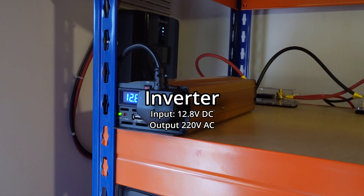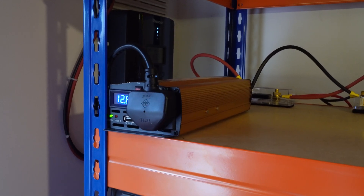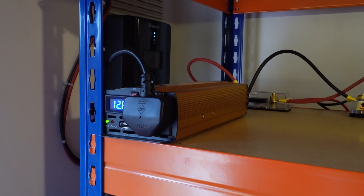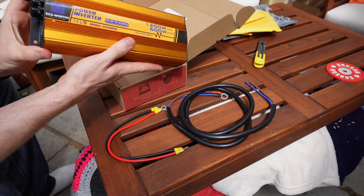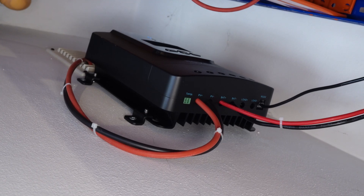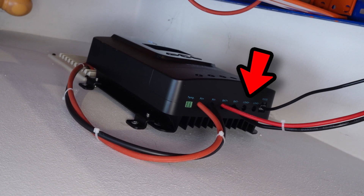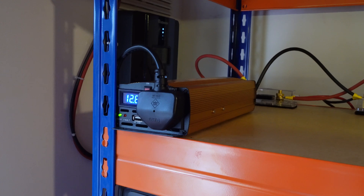The next link in the chain is this inverter. An inverter takes the 12.8V DC from the batteries and turns it into 220V AC, which is close enough to what usually comes out of the wall here in the UK. It came as part of the Ecoworthy kit that I bought back in August, and to be honest it's not brilliant, but it does get the job done. It's wired in parallel with the batteries and charge controller, obviously via a fuse. Charge controllers do have a load output on them, but on a controller of this size it's only designed for smaller loads like LED lighting, and it's advised to connect the inverter directly to the batteries. Allegedly this inverter will deliver up to 600W continuous with peaks of 1200W, but this is another part of the puzzle that I may either replace or eliminate completely.